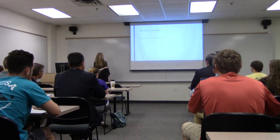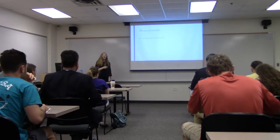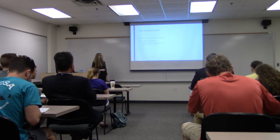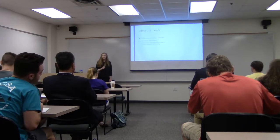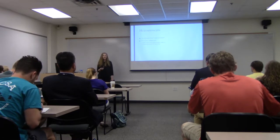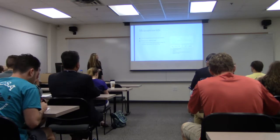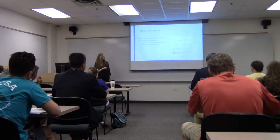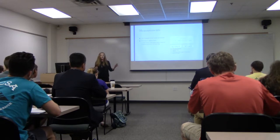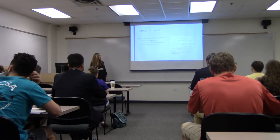So some measurements that I took throughout the testing process include air temperature and pressure to measure the air density in the wind tunnel. Also, pressure difference was measured using a pitot-static tube connected to two manometers, a digital and a U-incline manometer, and Bernoulli's equation was broken down in order to use pressure to find air velocity. And that's how I could relate the hertz that the wind tunnel speed is measured in to air velocity in miles per hour.